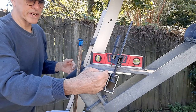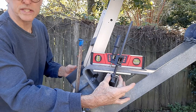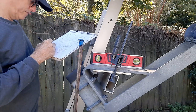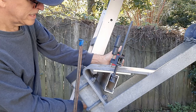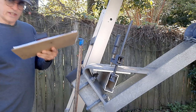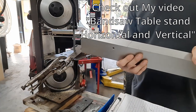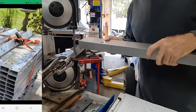None of my angles are lining up here. I've got this piece at one angle and this piece at another angle, and my plan is to cut the corner off so I have flat surfaces to weld to on both sides. First I need the angle of this piece — the ground isn't level and the trailer isn't level. I measure 3.65 degrees, then get the angle of the other piece, and with a little bit of math I know what angle to cut this at. I've got it marked right there — that's the line I'm going to follow. Cutting through that hole is what happens when you use scrap aluminum, but it's a whole lot cheaper and it's pretty much exactly what we need.